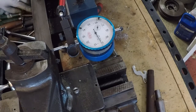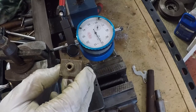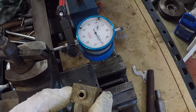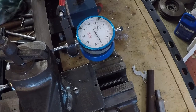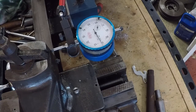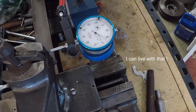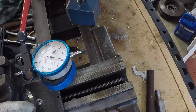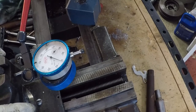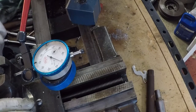What we did: we went in and took the new nut and shaved off 35 thousandths in the mill, then reset it in there. No washers, nothing — 35 thousandths was just barely enough to set it below the surface. So when the screw goes on, it's actually going to pull that into position and hold it tight. And that's my well-north-of-200-pounds leaning in it pretty hard.